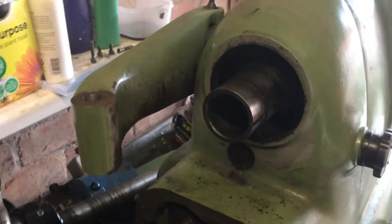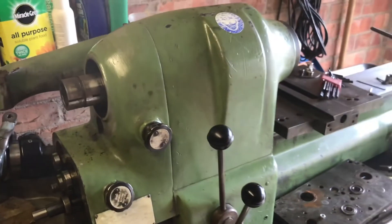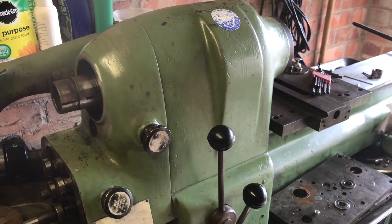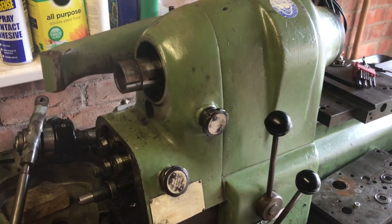So that's where we are at the moment. Around the back, as you can see, you can take off this pulley assembly or undo those lock nuts and then tap out the spindle from the back, which pops out the front, and then you've got to slide your new belt on from there. That's where we are at the moment — a bit of a boring video I know, but it's just the start of the journey. I'll try and get some better ones for you as we go along.